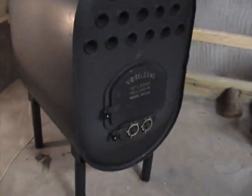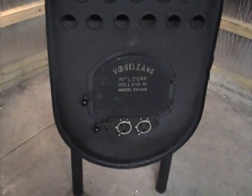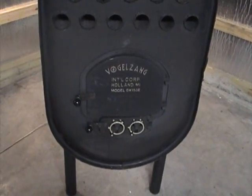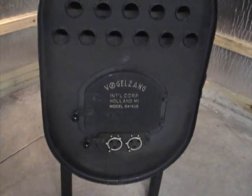First I cut out this door opening with a sawzall. It did have some fuel oil in it — it wasn't explosive, but I didn't want to use a torch and make a bomb. So I cut it with a sawzall and filled it up with newspaper wads and burned out the vapors.